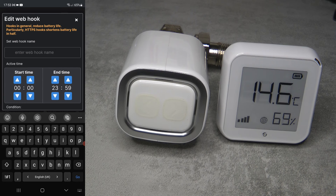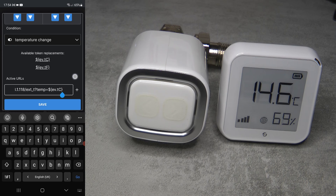Note this warning: when you define these webhooks, every time the temperature changes the H&T is going to wake up and not only send data to the cloud or server but also call these URLs. That's going to be additional drain on the battery, so either accept that you'll need to change batteries more frequently, or consider plugging it into the USB-C socket. Honestly, I don't think it will be that big of an issue - I've just discovered this so I haven't tested it yet.